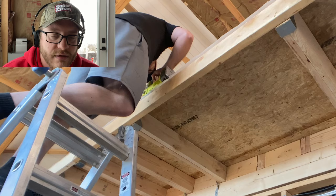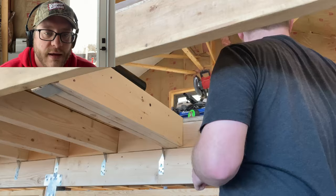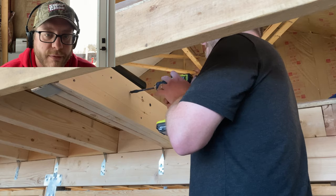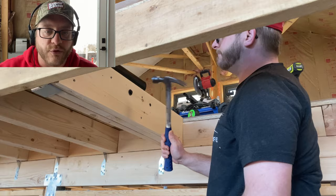First I started with the circular saw and then I finished off the corners with the jigsaw. Lifted it out of place and we're good to go. There you can see the opening, which I would later trim out a little bit more. Then I needed to drill the holes to mount to that top plate for the top of the staircase kit. Once I drilled the holes I was able to hammer in the anchors — in total there were six bolts at the very top to hold it in place, going through and holding itself to that floor joist for strength and rigidity.